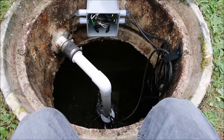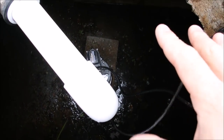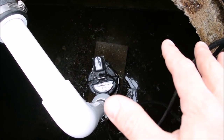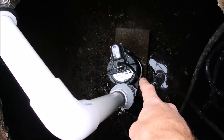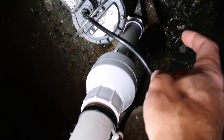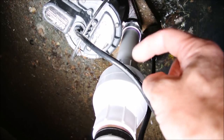Back to this — take a look down in. Right now what we're looking at is empty because I just had the septic cleaned, which is why I'm doing this now. The pump was killed — it was shot. So what I did was I found the correct pump, and down at the bottom of the pump where it attaches in, you put a little hole to prevent airlock.